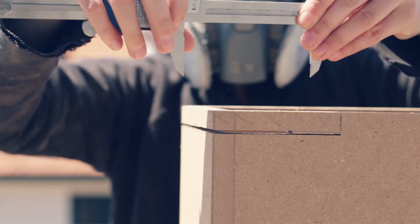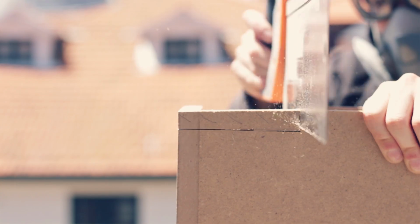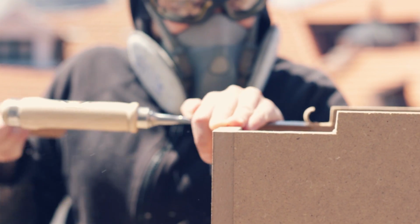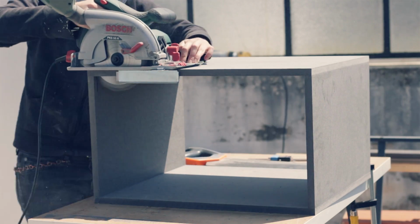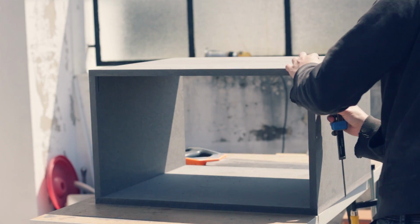Because the backer boards in the floor boxes need to go a bit forward into the box space, it didn't make much sense to rabbet those, unless I would make a very deep rabbet. Instead, I just cut those backer boards a bit smaller so they would fit perfectly inside the box and nail them in place, as you will see later.